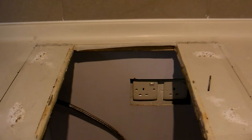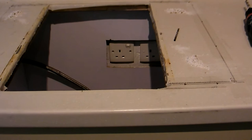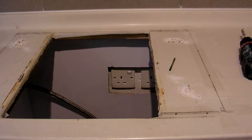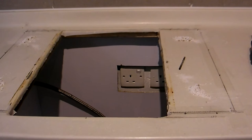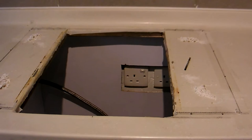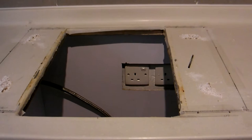I've got a couple of thicknesses of the underlying material to work through, so that jigsaw blade is going to drift. I don't expect the hole to be all that straight — I'm expecting the blade to go wonky. Those blades are real thin and they tend to drift laterally, so you end up with angled holes if you push the saw at all. I'm going to use a very fine tooth blade to reduce the chances of chipping. The corner holes are now cut out so we're committed to this size, and you can see the original line and then the line that's about three or four millimeters closer to the front of the countertop.